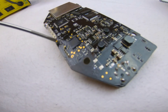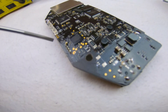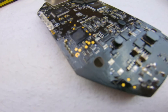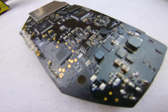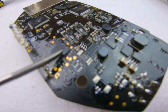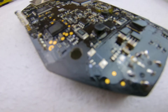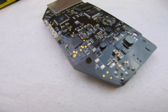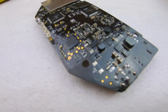I created a small aluminum shield that isolates this chip from the LEDs, just a little piece of aluminum or tin I had laying around. That seems to direct the airflow there along with this rather small tip. It's important to be careful, remembering that these are coated with some type of plastic or epoxy on the outside. This will be my third run through, second focused specifically on this chip, and I'll heat it a little more this time.